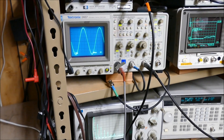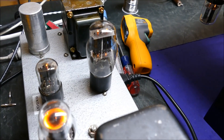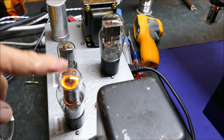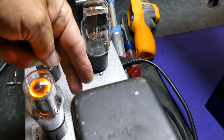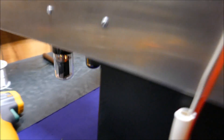What I'm looking at right now is just the driver's section. This is the power supply bias, and this is the power supply for the 6V6. This is the bias rectifier, and this is a VR75 just to hold the bias voltage constant. Here is the bias adjustment right there. And here's the 6SN7 and a 6V6 right there.